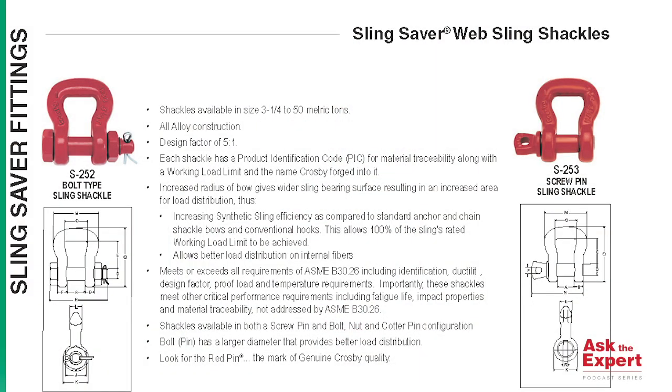Let us take a look at Crosby's catalog page for further details pertaining to Crosby's Sling Saver Web Sling Shackle line. Both the S252 and S253 are available in sizes 3.25 to 50 metric tons. All are made of an alloy steel construction. All have a design factor of 5:1, and each shackle has a product identification code for material traceability, along with a working load limit and the name Crosby permanently forged into the shackle bow.